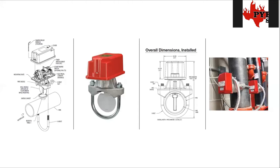These water flow switches are pretty much always so close to the sprinkler pipe that the flex conduit needs to end with a 90-degree connector. That last picture shows it fully installed — you can see you're not able to see the paddle because it's sucked up against the pipe. Those paddles are typically made of a flexible material so they can fold or roll them to get them into the pipe, since obviously they can't cut a hole the full size of the pipe.